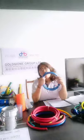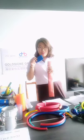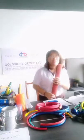Now, another hose we deal in is the PVC air hose. Mainly we talk about the PVC pneumatic hose, and it's very widely used. The size is 1/4 to 3/8 inch, and the working pressure is 20 bar. Also, we produce the PVC layflat hose, and usually they are agricultural type and industrial type. Some suppliers only can produce to 6 bar, but we can produce to 10 bar. And for example, about the 2-inch, some suppliers can produce to 52 millimeter, but we can produce to 53 millimeter.